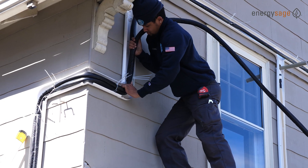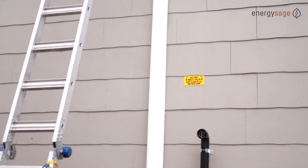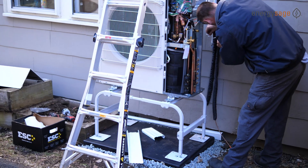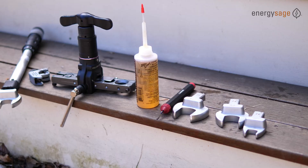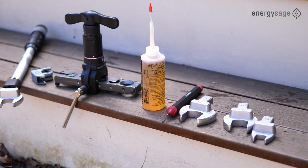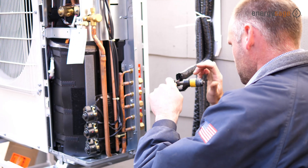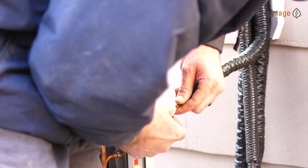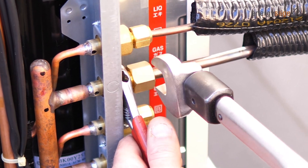In this system they opted to run some of the lines through the basement. Since the indoor and outdoor units aren't all on the same side of the house, running down the side of the building and across the basement ceiling turned out to be the shortest and cleanest route. This heat pump uses flared connections rather than brazed or welded connections — you don't need a blowtorch. You can see Wayne using a bunch of specialty tools. For every connection point — four total per head — he needs to score and cut the copper to length, clean its edges, shape the endpoint properly, and fasten it with just the right amount of torque.